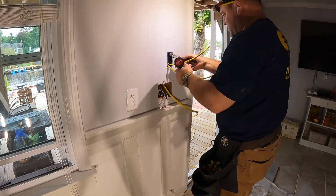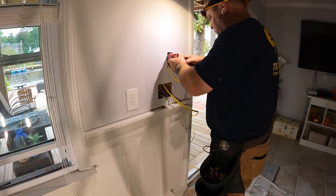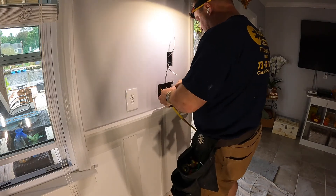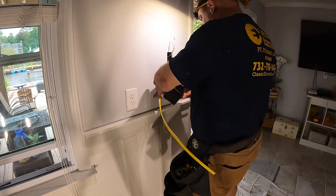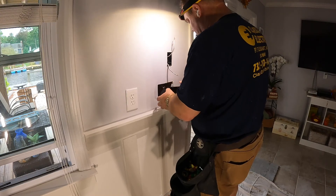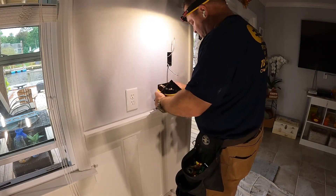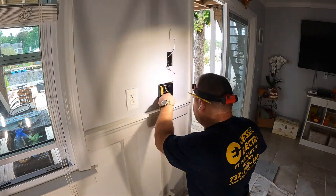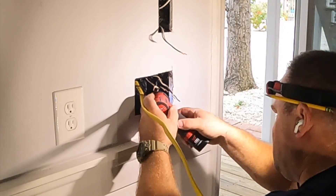The next step is to snake the wires from the outside junction box down into the switches and the thermostat. My main objective in the morning was to get that electric heater in, get my switches and cover plates on, and get the line voltage thermostat connected — so that in the afternoon I could work on the junction boxes and getting my PVC from this area of the house back over to the panel. I just wanted to get this done in the morning so my afternoon was a bit lighter.